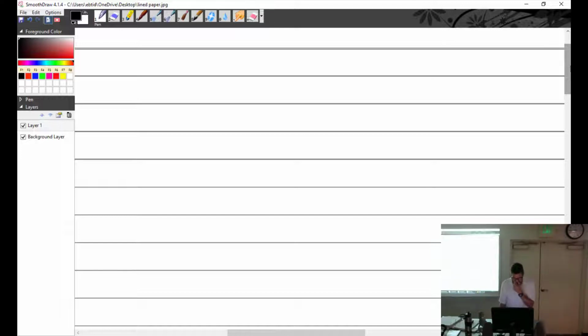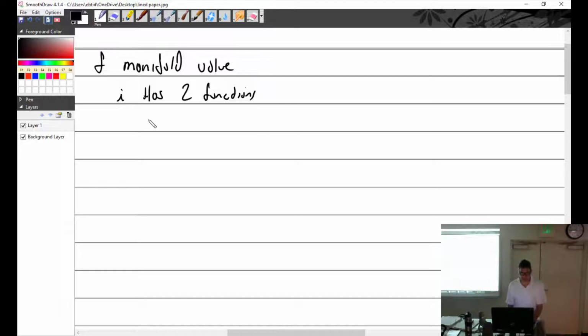And obviously, I'm not going to write this as throttle's closed, less fuel sent off to the manifold valve. Let's talk about the manifold valve. It has two functions. How many did the Bendix have? Three. Okay. This one has two. They are one, two. What are they? You knew the Bendix, you should know these. Allows fuel to flow to each cylinder. To each cylinder. All right.